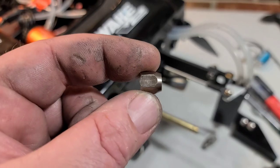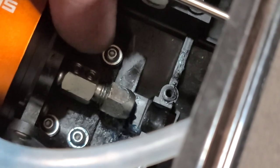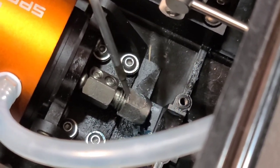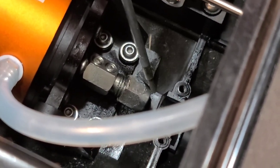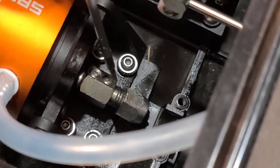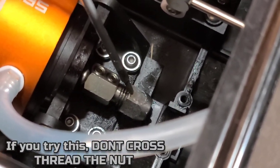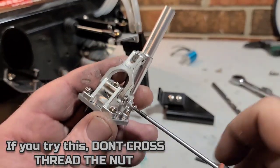I had the same problem with the V2 - the nut on the collet was bottoming out on the base. What I did was take the collet out to my bench grinder and grind off about 1.5 to possibly 2 millimeters off the front side of the collet - the side that butts up onto the base, where the nut part is. That way it won't bottom out and start spinning. I think that's gonna save these collets. You'll see when I tighten it up.